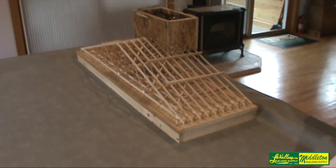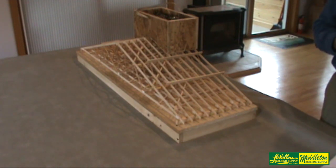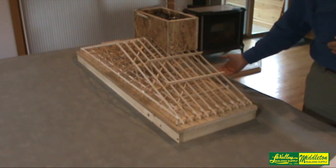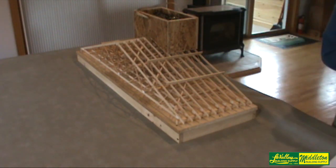I went to a professional engineer to seek help and he was pretty excited — he said we could save them. Basically the fix was cutting the bracing off from the first truss, getting it straight, bracing it to the ground, and then pulling them back one at a time, connecting them to that solid base truss. About two weeks after my visit, the building collapsed.